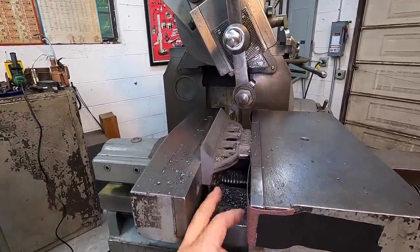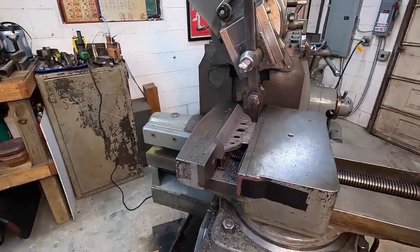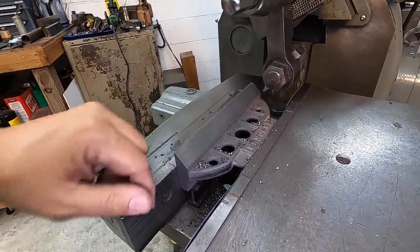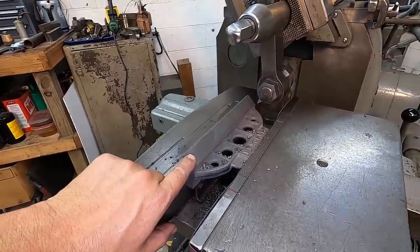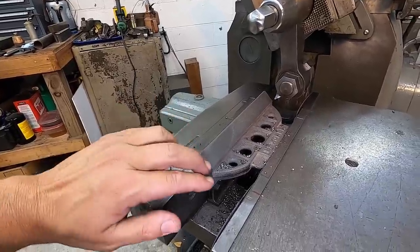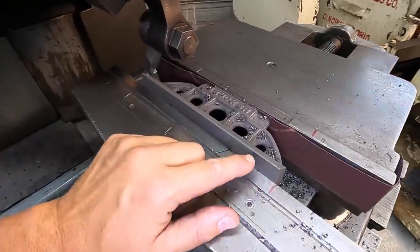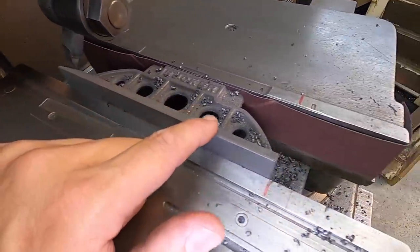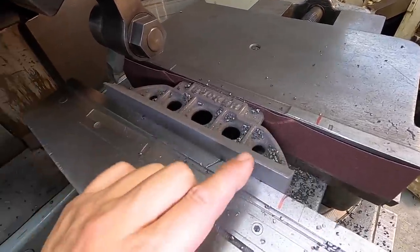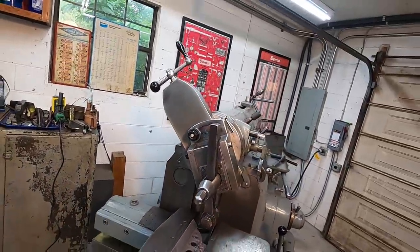You're able to set it right down on that parallel in the machine vise, clamp it in right there, and we got our angle. Now the finish isn't going to be as nice as a mill finish, but this is going to be a scraped surface — so as long as it's machined nice and straight and true with the other side, that's all we're looking for. I'm going to go ahead and continue cutting this until we get this edge completely cleaned up. We want it to match the bottom right there, and then we'll just file it and get rid of the sharp edge. It's doing good — this works really well this way.